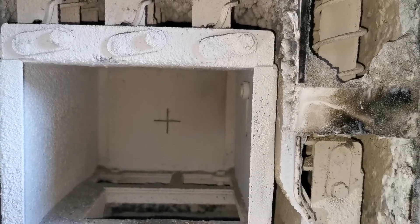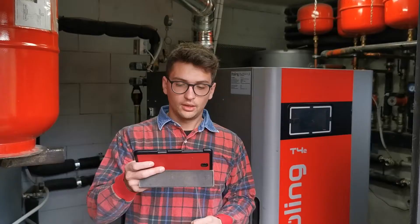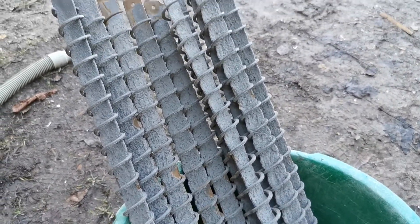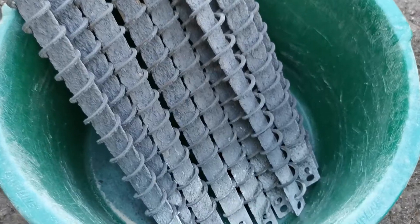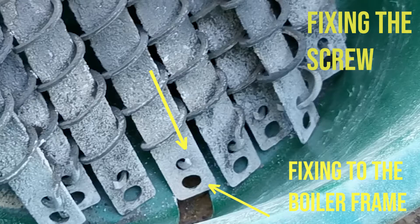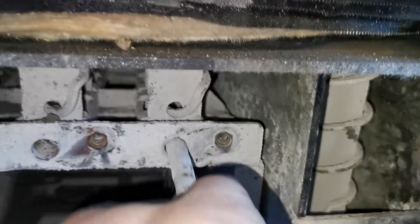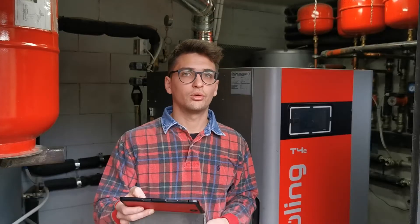Once you have opened both covers you can clearly see the second collecting screw for flying ashes at the bottom. A tubulator is not composed only of the screw — there is also an internal long strip. This strip has two holes: one to fix the tubulator itself and another in which you insert a pin to connect the tubulators to the frame. To unlock everything, you unscrew the 13mm nut and by pulling you can remove the pin, detaching the tubulators completely from the frame.